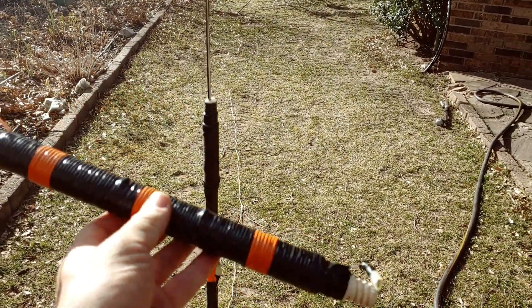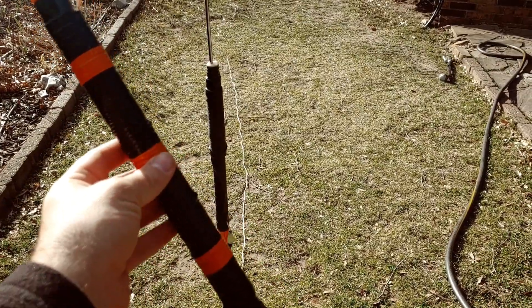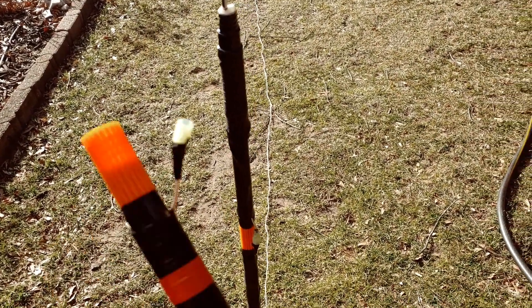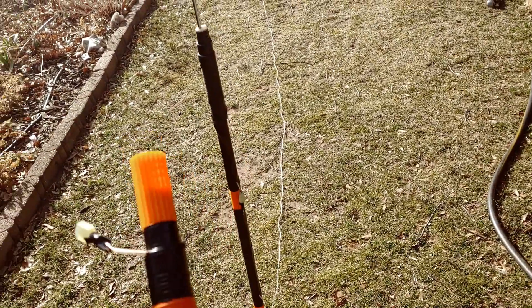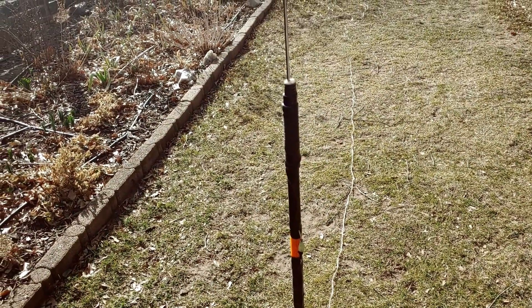What I wanted to do is see if I could also wind a 40 meter coil and put it in here. And so that's what I did. If there are about 48 turns around 50 turns for 20 meters, this is like double that — a lot of speaker wire used. But lo and behold, I did it. It kind of works, so hang on one second and I'll assemble that and let you know how it goes.